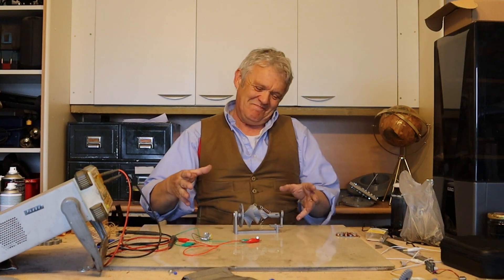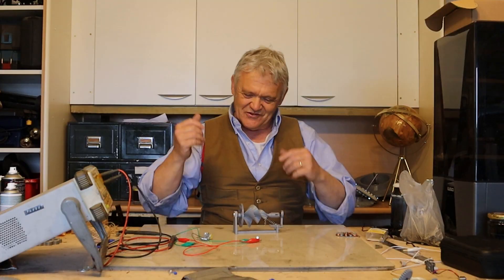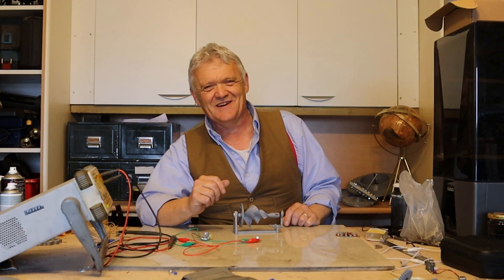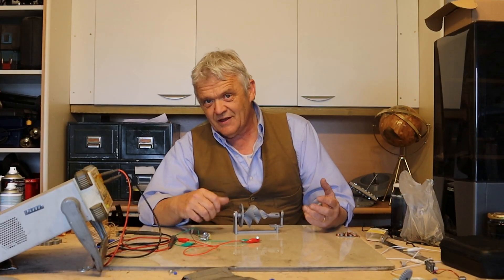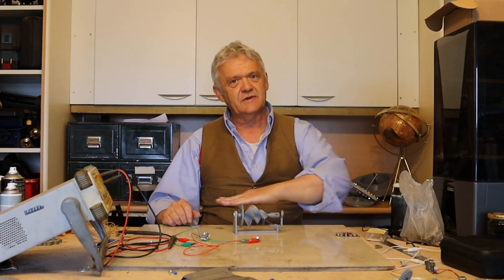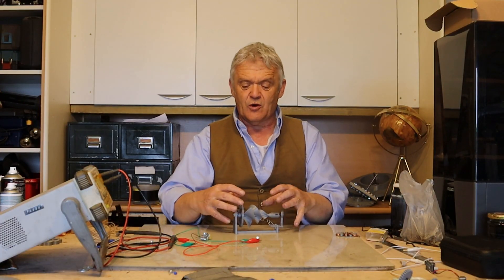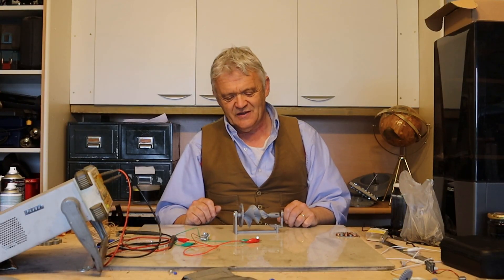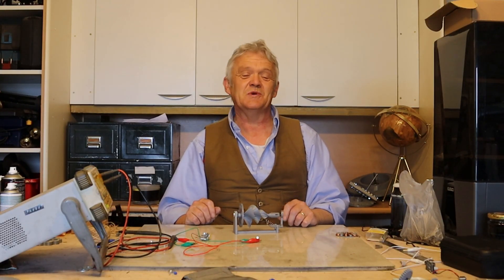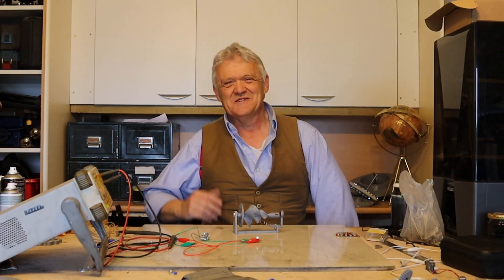There we go — that's my ballpoint pen inspired, magnetically levitated, frictionless bearing in a wind turbine producing some energy. It is a model as a proof of concept, but it certainly works. In answer to how do you do it in that direction — this seems to be a pretty good way. Of course, if we add more weight we need stronger magnets, but I was quite pleased with how that little model worked. It's absolutely pouring down with rain or I would have taken it outside. I hope you enjoyed the video — thank you very much for watching, and please do remember to like and subscribe.